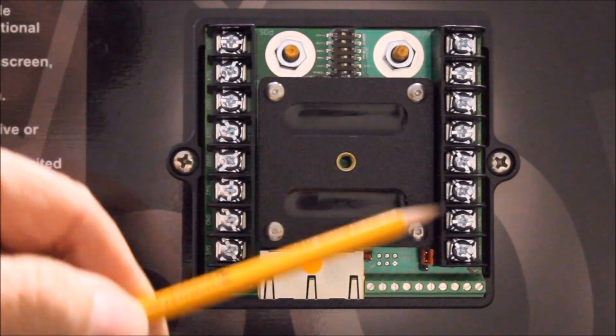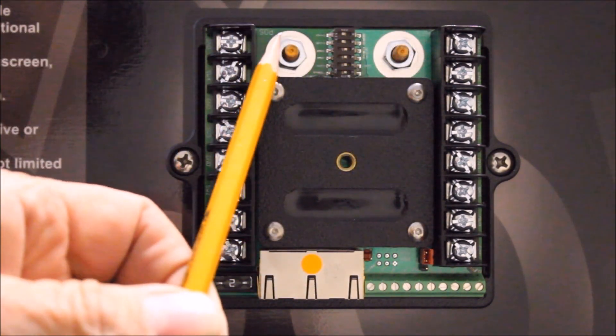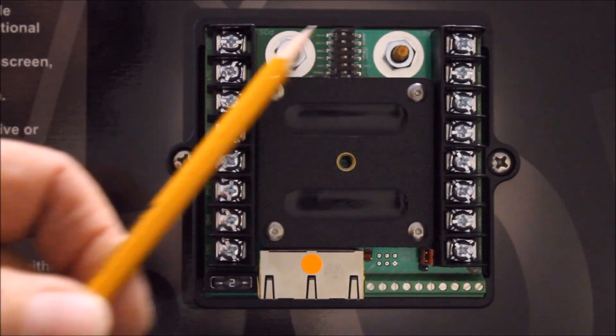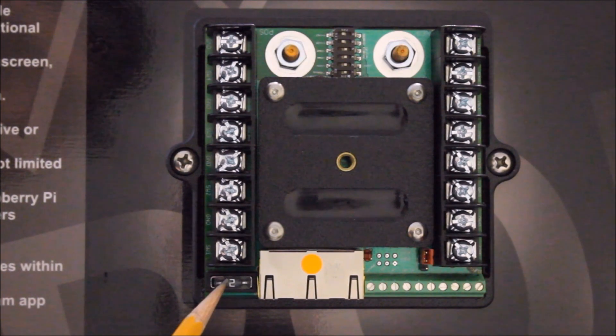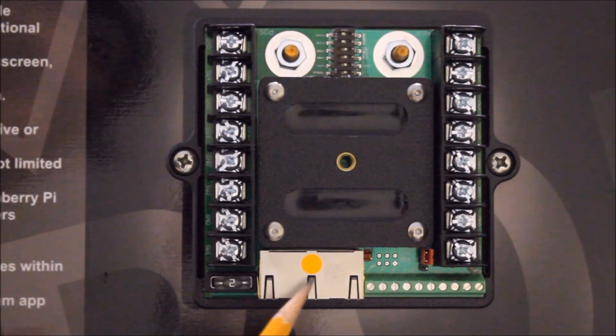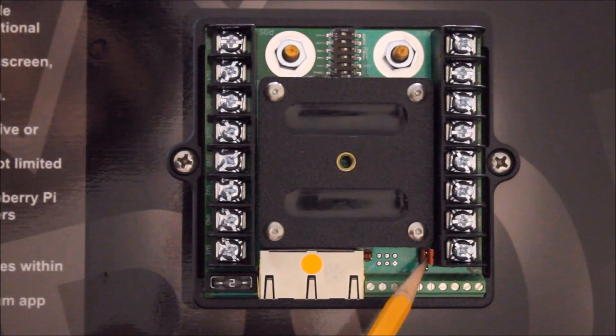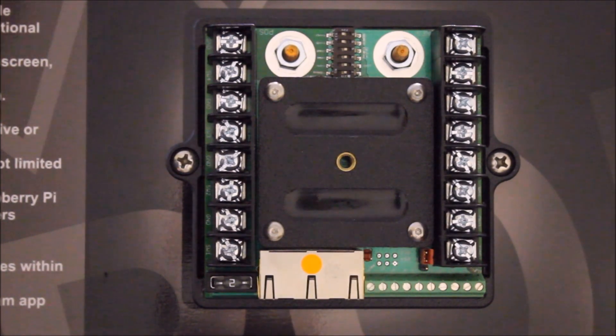On the right hand side is switches 5 through 8. This is your positive battery stud, negative battery stud, 2 amp fuse location, and over here are two input ports for your control cable. This is an input terminal block for all your controllers and for low voltage detection and ignition control. This is your jumper for the negative input and positive input.